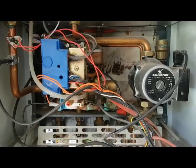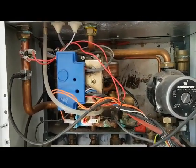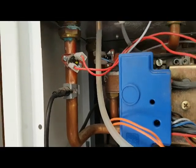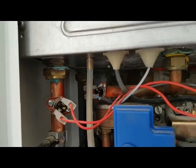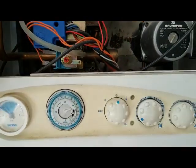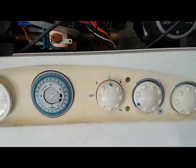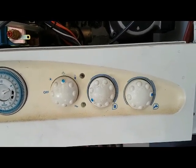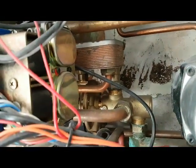For the heating, more or less the same applies. This thermistor works for both heating and hot water. That's your main overheat thermostat, and you've also got another thermostat at the back. For heating, the demand is done via the timer and any external controls like a room thermostat. Your selector switch has to be on for heating, and your thermostat on the front of the boiler has to be turned up. Once they're all on, everything else is the same — the diverter valve will be at rest so you just go around the heating circuit.